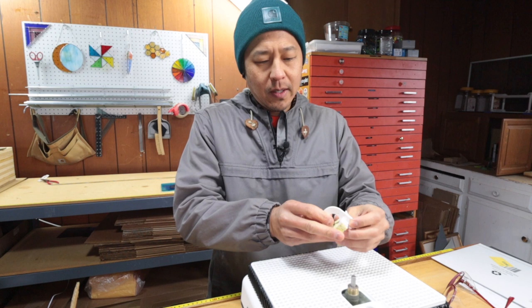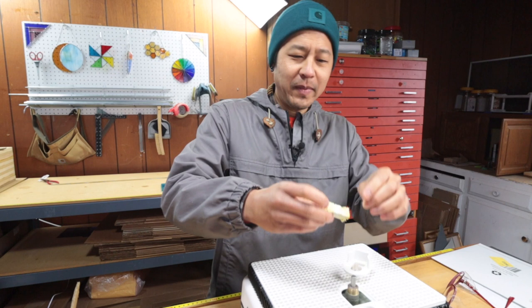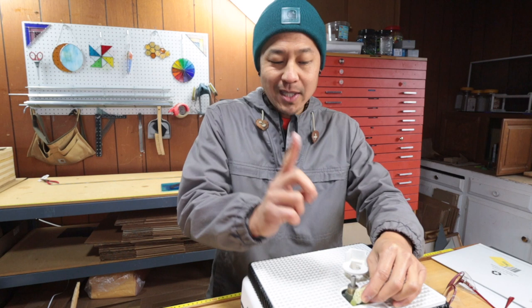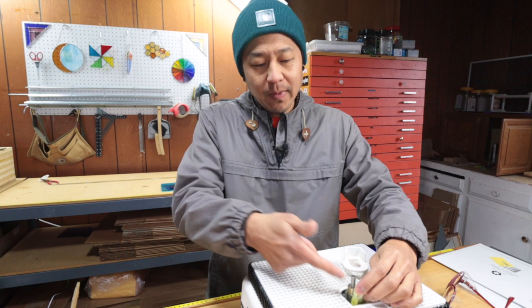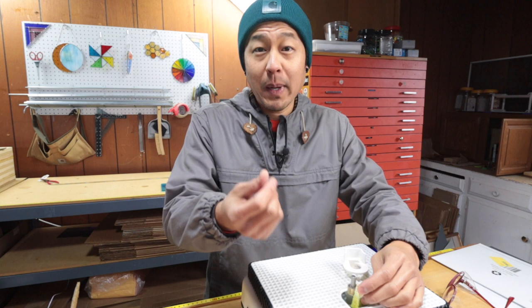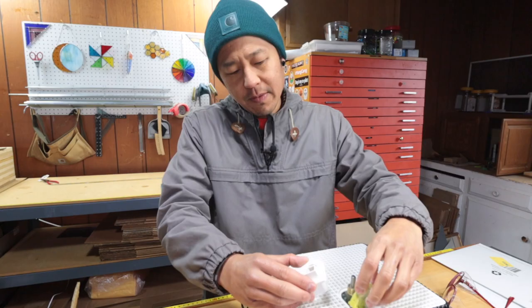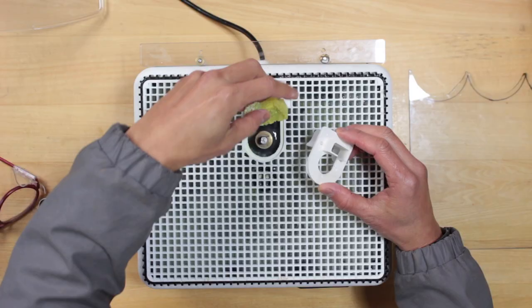It's pretty dried up. It's been sitting for a very long time. So, kind of wet the sponge there. What the sponge will do is absorb the water, and then that sponge will be touching this grinding bit. As it's spinning, it's touching the bit, and so it's cleaning off the residue, the glass that gets picked up from getting stuck on the grinder bit. So that sponge will clean it off, and that's the idea of it. So we just kind of have to let it sit. It's still trying to absorb.